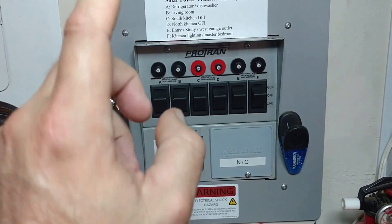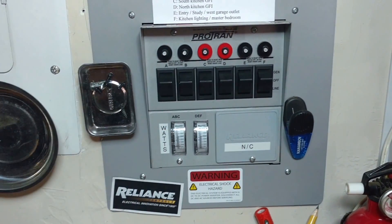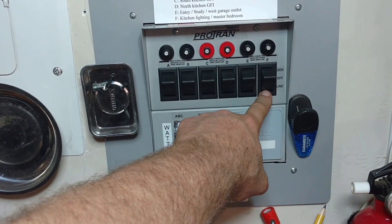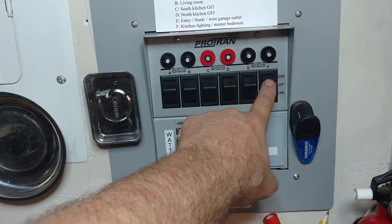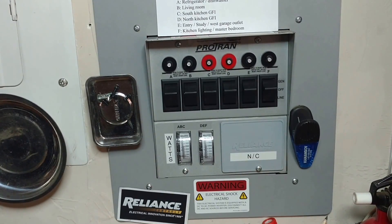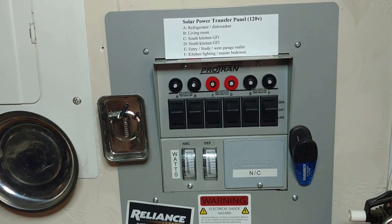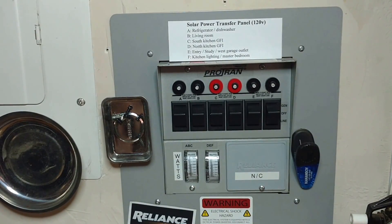It's a six-circuit transfer panel but there's a lot of stuff it powers. I would have liked a 10-circuit panel, but for my system it's doing well in the summertime. One note on the master bedroom: I'm running a smaller portable solar generator — that 24-volt one that looks like an army surplus box — with 600 watts of solar panels on the pergola. I use that to run the air conditioner during the day, then at night I unplug it and switch back to grid power during lower-cost hours.